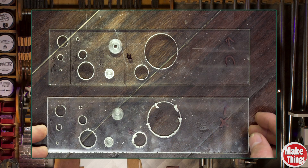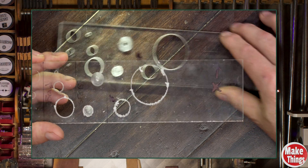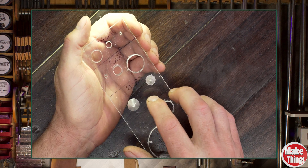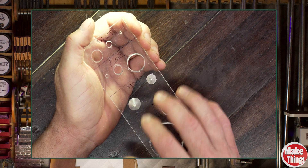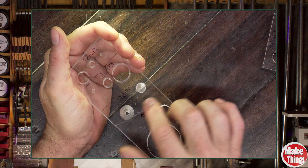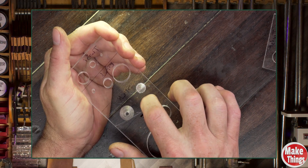It's really easy to see that the cast cut so much more beautifully — the edges are cleaner and I don't see any distortions, whereas the extruded has some really messy edges. I found bulges on the backside of the extruded, especially from the single-flute countersink bit where it wasn't able to cut all the way through. On the cast, it cut through cleanly and I don't even feel a bulge on the other side.